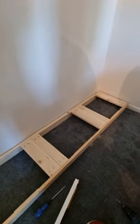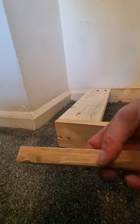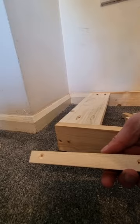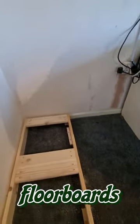Then we proceed to put packers in. The front row here has got little window packers — these are the type of packers that we use, several packers down there. Once we've got it all packed onto the floor, we use these pieces of timber which are about 22mm by 22mm, and we countersink and pre-drill them, screw the whole thing through the carpet onto the skirting boards, and then one final check.